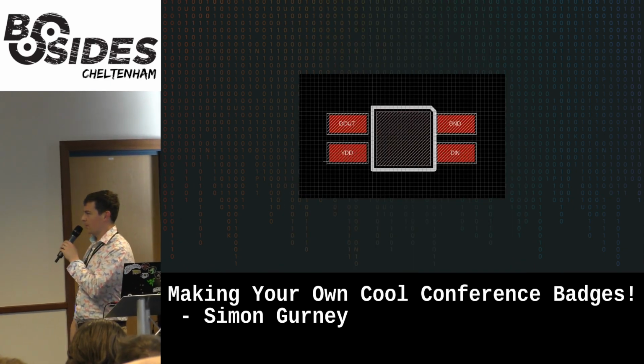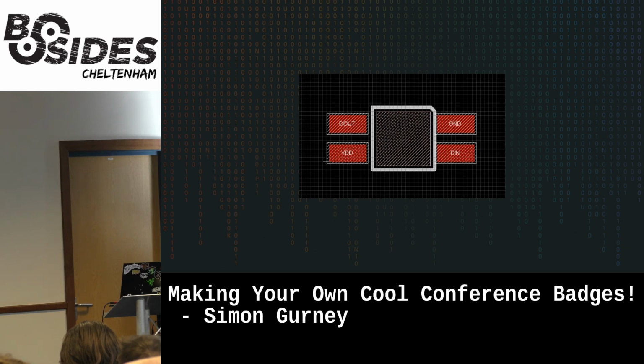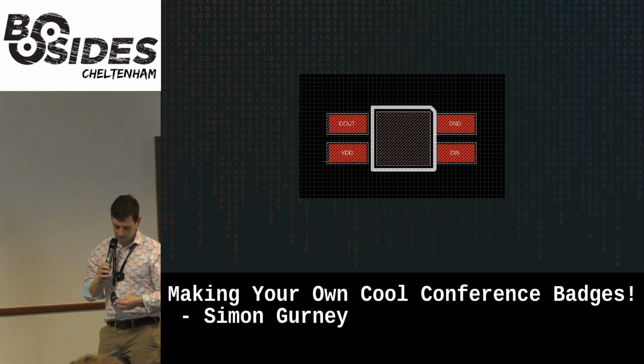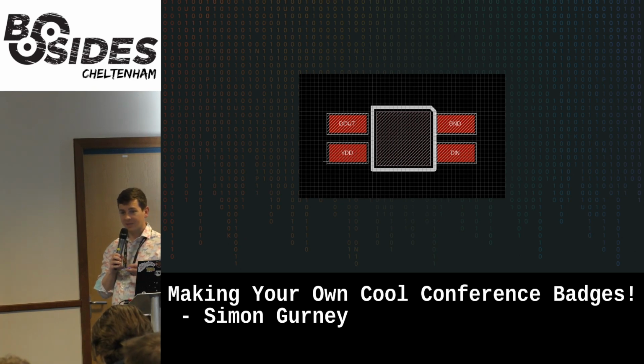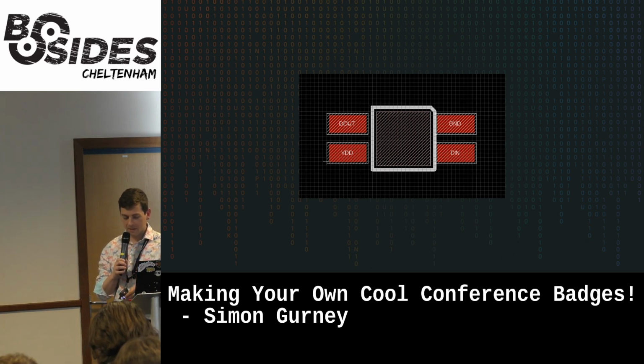And this is what we want the footprint to look like. So if we go back, see it down below at the bottom. This LED is slightly interesting. This LED is keyed, so there's a little line there, and you'll notice this very subtly on your... No, you won't because you haven't got any parts on them, have you? But if you did, you'd see that I've put little white markers, like a SIM card shape. That's to say that particular pin has got a cutout on it.